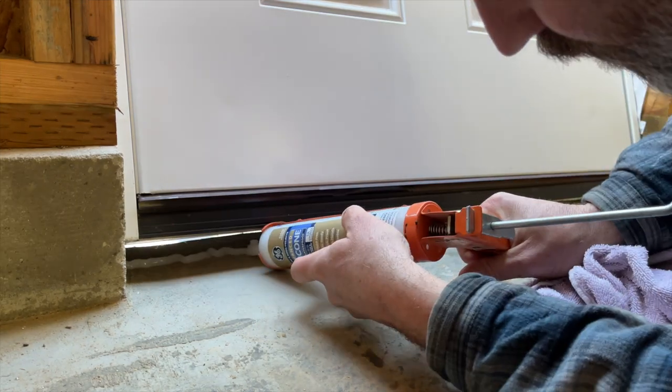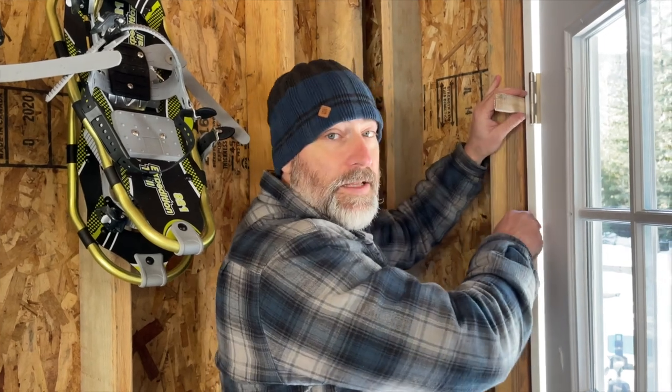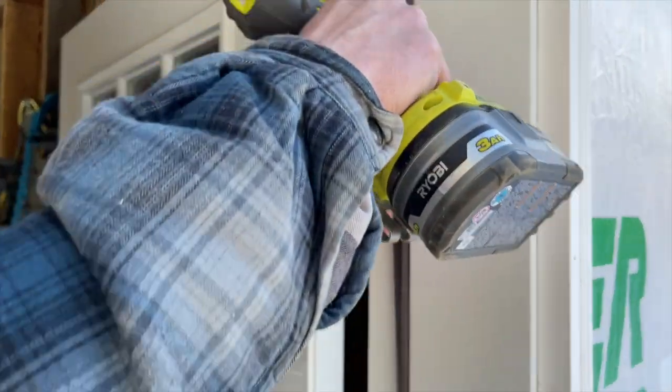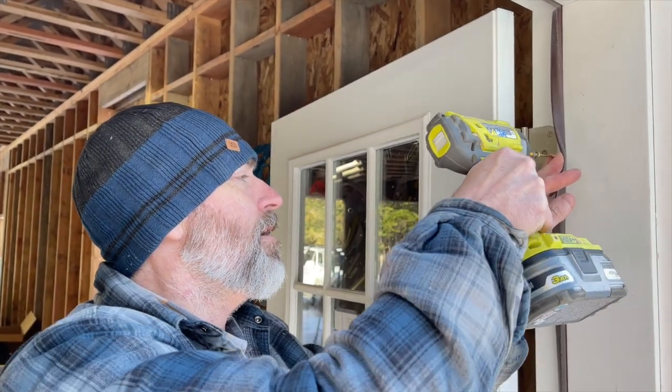Jules is holding the door out right now and we're going to silicone all underneath so any water that runs down the door won't get into the garage. We're trying to get the shims figured out so we can mount the door in its opening — get the shims all set up, screw them in, do the other side, and hopefully the door will be square and open and close nice and easily. We pre-drilled a countersink under the weather stripping so the screw goes beneath the surface of the wood.